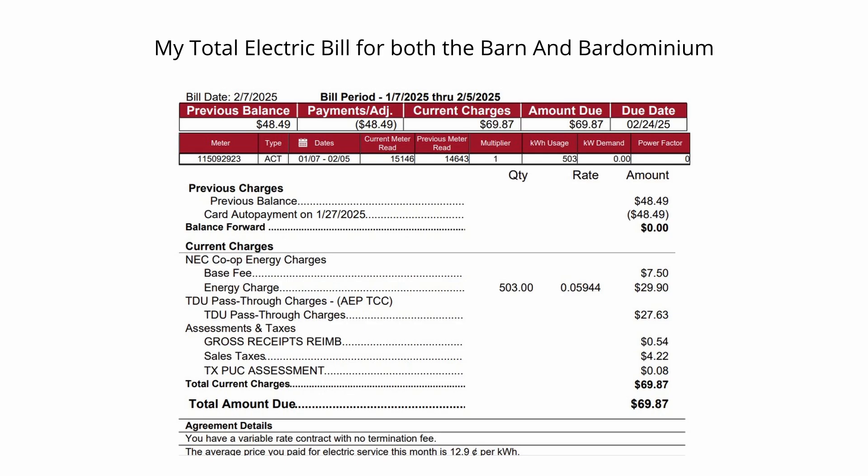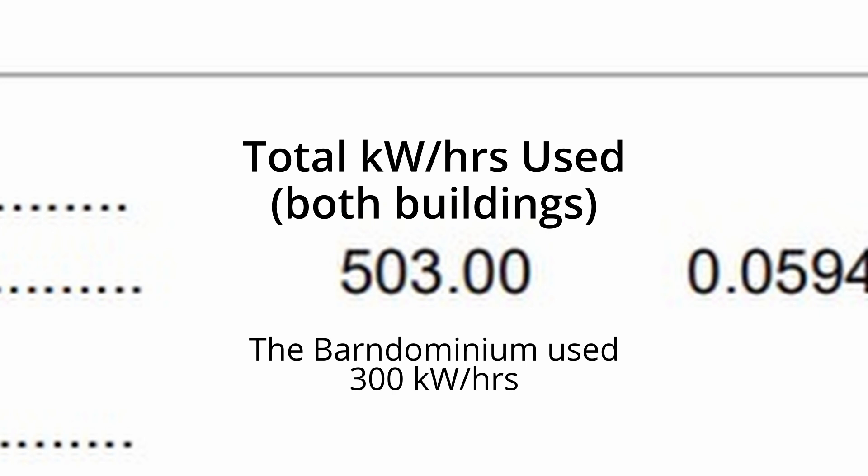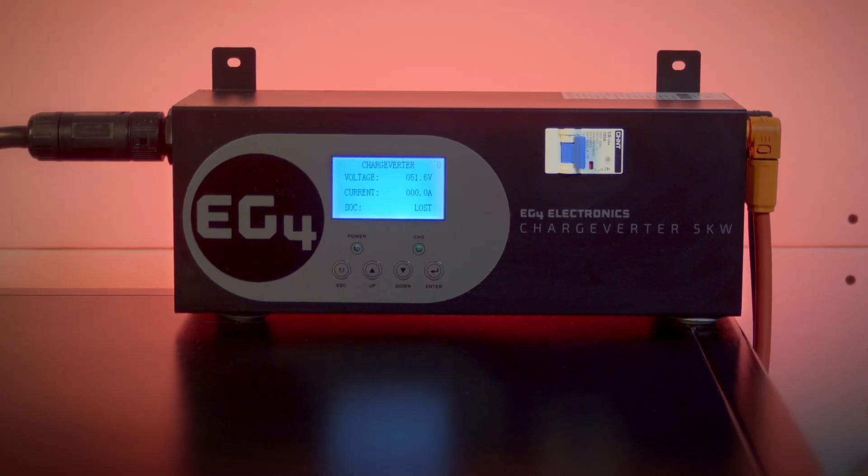Let's take a look at the electric bill and break it out. I was running a space heater in the barn — the barn has a second story that's finished out like a guest house or in-law suite, and that's also where I was storing stuff and staying while finishing this building. I ran it on medium, which on that space heater is about 1,000 watts, which makes the math really easy. Looking at the inverter data, there were definitely days where I used a lot more electricity than the panels were putting in. I made up for that by setting the charge inverter to charge at about 30 to 35 amps — about a 2,000 watt draw through that contraption of extension cords, which you could not do at 120 volts over that distance due to voltage drop. So I used a 50 amp, 240 volt circuit in the barn.